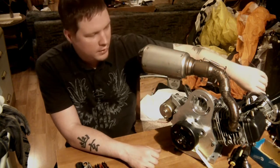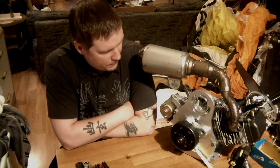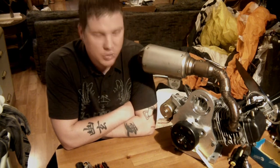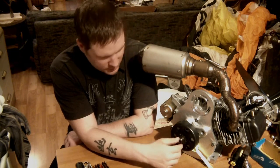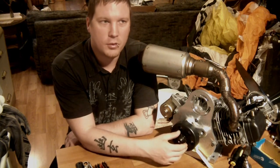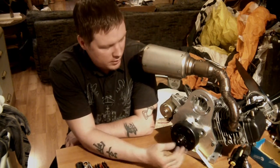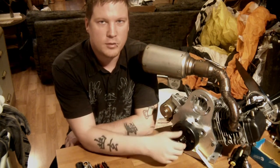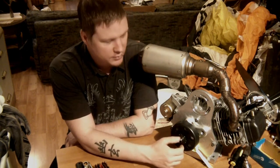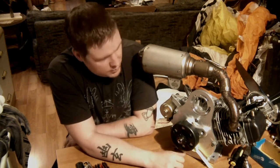This engine is 212 cubic centimeters. Even though it is a four-stroke, which are not as strong, this is definitely a bigger four-stroke. It has a hemi head which produces more flow, and I've designed a tuned intake for it. Basically every part on the inside, which I'll go into in the next parts, is aftermarket, performance, or at least modified one way or another. Almost forgot about cost — if I did my math right, the engine itself, if you subscribe to Harbor Freight coupons, periodically they have a coupon for this engine for $99. You've got to make sure you're getting the hemi version, not the flat head version.